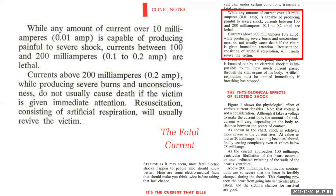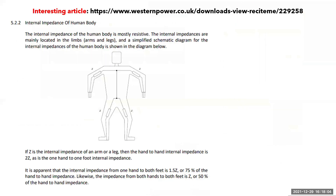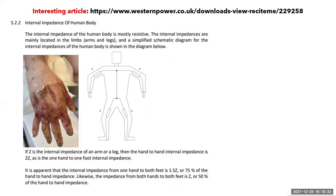If you're being left in charge of jobs while your employer leaves the building and goes elsewhere, you need to be in control of the electricity and ensure that it is switched off and isolated. Because if there is an accident, there won't be anyone there to revive you. Once the electrons penetrate your skin, your body contains different impedances through each body part. If you were to become part of the circuit, electrons would start to flow through your body, causing tissue damage. Your body is also controlled by small electrical impulses — these are disrupted and overridden, which can be detrimental to your bodily functions, for example stopping your heart from beating, your lungs from working, as well as heating up the flesh and literally cooking you and potentially destroying your body cells, with short term effects and long term consequences to your health.